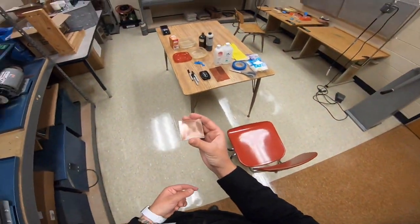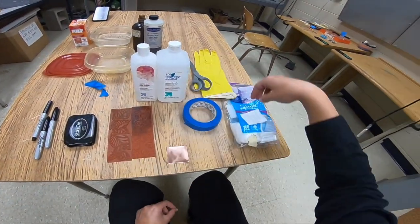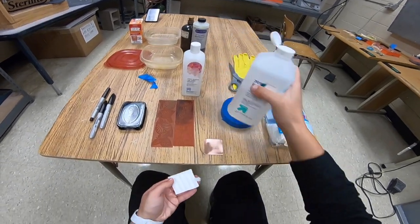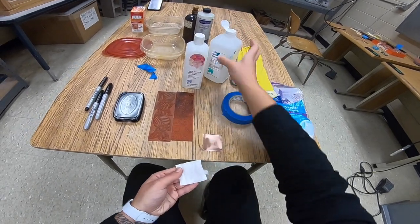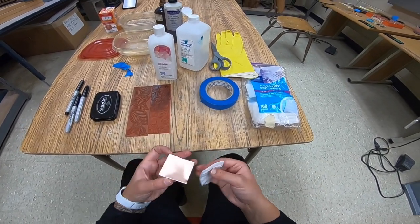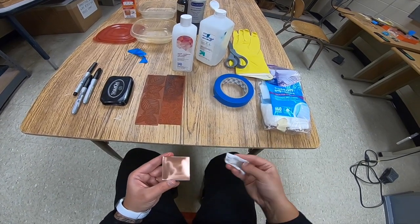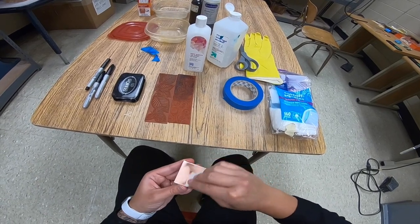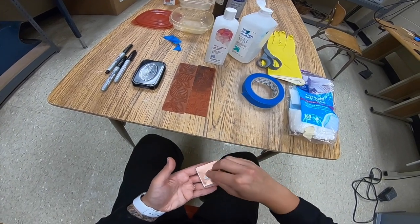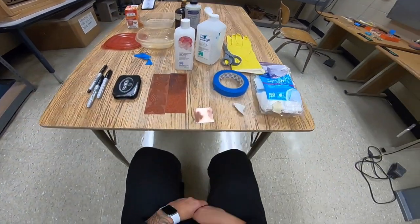Now I'm handling my metal just by the edges, avoiding the clean surface. To clean the metal after sanding, we're going to use a cotton swab with either acetone or isopropyl alcohol. This will take any leftover residue or oils off the surface. I'm touching it only by the corners or edges and just swooping it over the surface. It's going to air dry and it's cleaning off all of that dirt. Make sure you don't leave any leftover cotton on it when you're wiping.